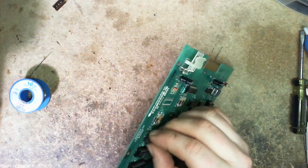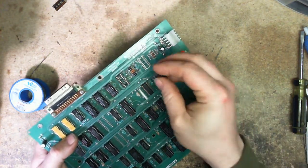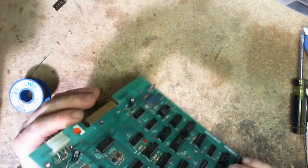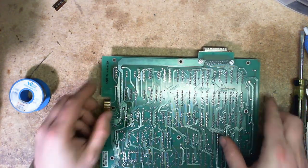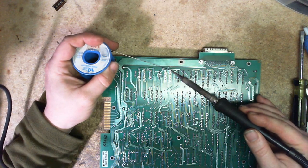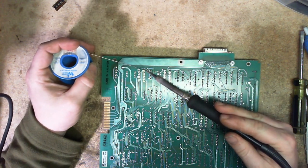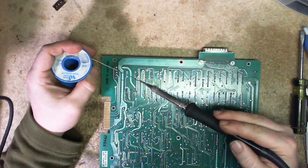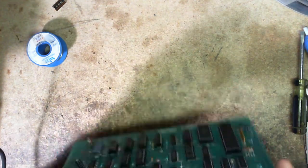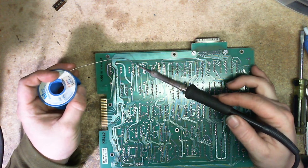Alright, I'll put that in. There we go, and I have another one here — I will put that one in. And if I don't like these, I will not bend one or two of these pins, because it makes desoldering and removing them very easy. And because I was very gentle on the desoldering, my pads are still in excellent shape and I can do this again. Is everything aligned? Everything looks aligned. And back to soldering we go.